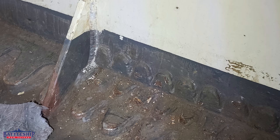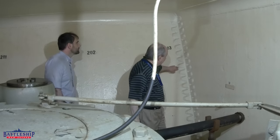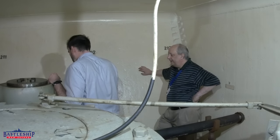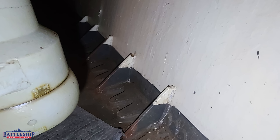Below us we see a double row of scallops. There's a first row that was used to line the armor up, and then an angled scallop that's welded on top of it that actually secures the armor to the deck. Over here in the corner, you can see the typical angle of scallops cut into it. There's also a row of triangular braces visible in the armor against the armor — that's where the rudder post is, reinforcing the mounting of the rudder. The area right below us is very heavily built up — it's a giant weldment designed to keep the rudder structurally in place even in the event of an explosion nearby.